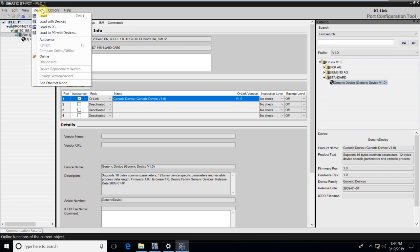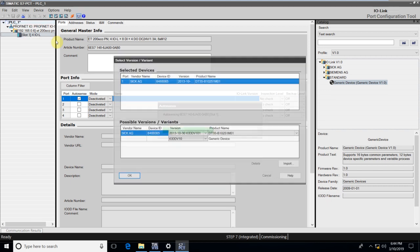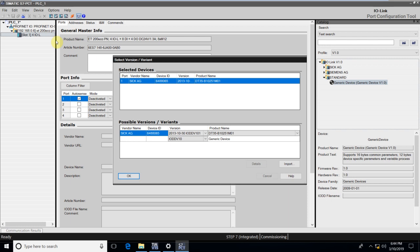We go to Device, select AutoSense, and click on it. AutoSense now goes and looks at what device is connected to the port. And behold — AutoSense has detected the presence of the DT35 at port one on our device. I no longer have to look at ports and the corresponding sensors. All I need to do is have the IODD file for all devices and sensors in my library — which is right there in the catalog on the right — and let AutoSense detect what sensor is connected at what port. In this case it's the DT35. I select OK.